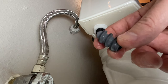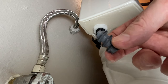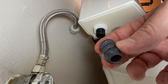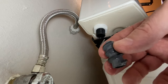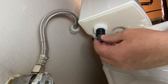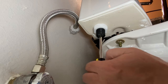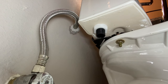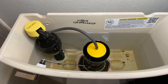Now let me tell you — if you left this piece out, you're actually going to get the full water pressure of your house, whatever PSI, the whole force. Personal opinion: you don't want to do that — you could get some serious water hammer. What I like to do is take this out and make sure there's no debris clogging it, because something could get stuck around in that area. Once you see this is clear, everything else should be clear. Put it back in — it just pushes right back up in place. Then hook this up, put it together, turn the water back on, and give it a flush.